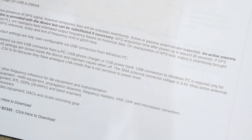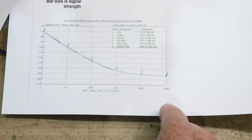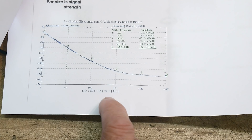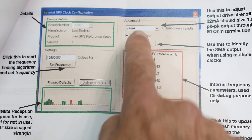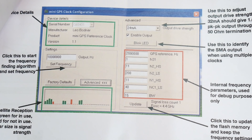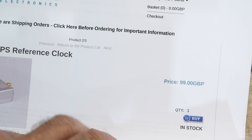It says it's low jitter. So why do you want one of these things? They are small. Here's some data about it settling. And this is a noise component — dBc/Hz versus Hz — so it gives you a kind of an idea of the phase noise. Here's a picture of the software, and this is where you can change the drive level. It seemed to work best for me at 8 milliamps, just driving a counter, so it shouldn't need a lot.